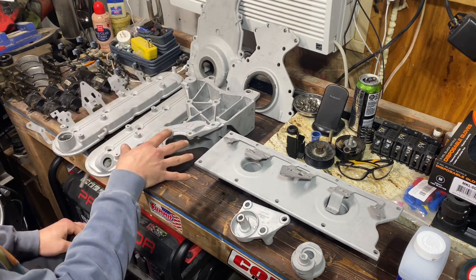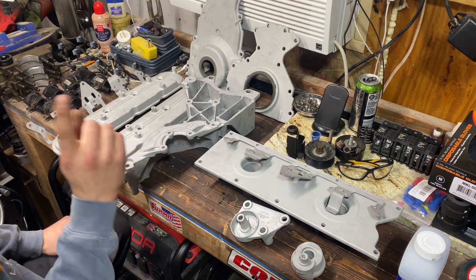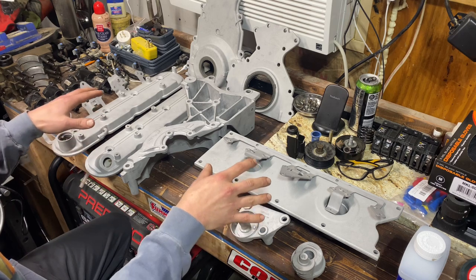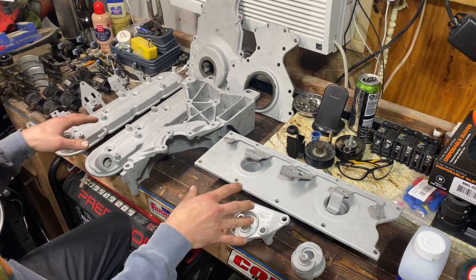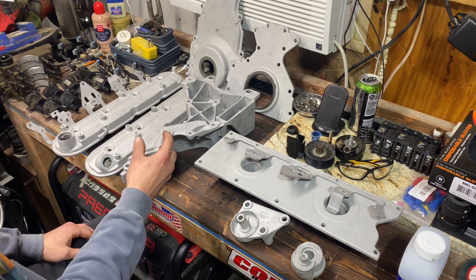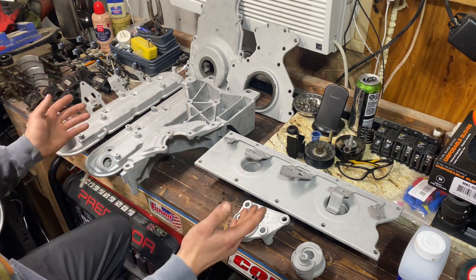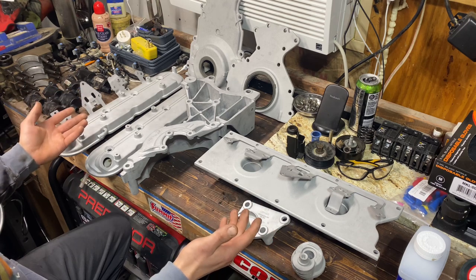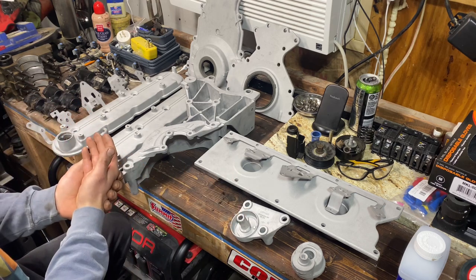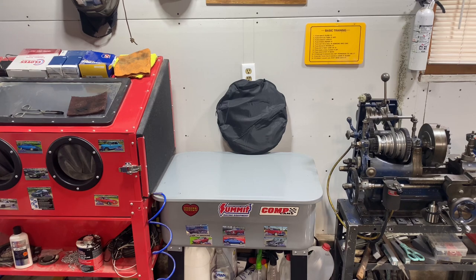These are actually going to go into the oven and get pre-baked. You're probably thinking oh no, hot flocking - but no, I actually want to outgas these aluminum parts. The steel parts will be okay. These aluminum parts are going to get baked 50 degrees higher than the cure temp for a bit just to outgas, because the pores will open up at the higher temperature and allow more of the gas from casting out. Whereas when we bake at our cure temp - which will be 400 degrees for what I'm using - the pores won't open up as much, so they shouldn't outgas during coating.